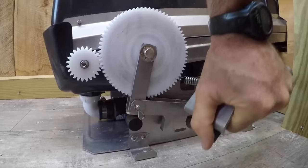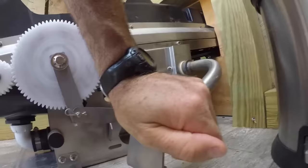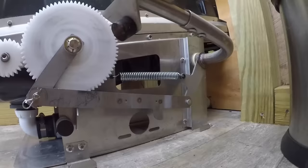Here's a closer look at the foot pedal mechanism. There are rubber bumpers that limit the motion of the foot pedal at each end of the stroke, and the gears are made of very strong resin material. There is a way to adjust the tension on the conveyor belt in case the foot pedal makes the advancing drum slip instead of engaging the belt at a good tension.